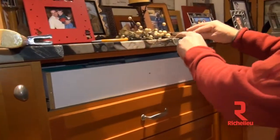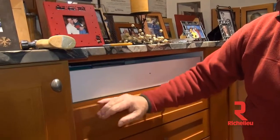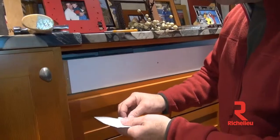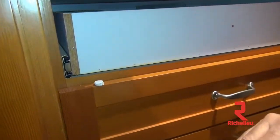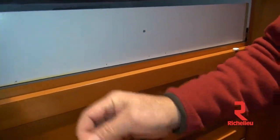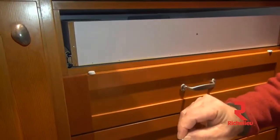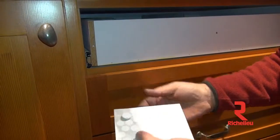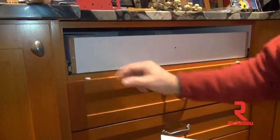The next step is to create a shim for our spacing between our drawers. This is about a quarter inch. You could use it any way you want, but I'm a FastCap guy so I use FastCaps. I love them because they stick and the shims won't fall out. I just stacked them up here in advance. If I need to make it a little skinnier, I can put one more on, or thicker, put one more, or take one off. When you're done with the shims, you can just stick them right back on your sheet. We've got our shims predetermined on our height.